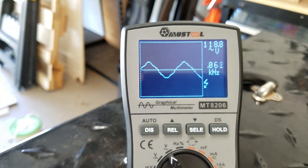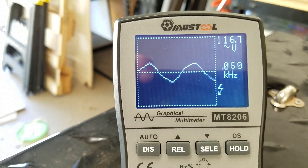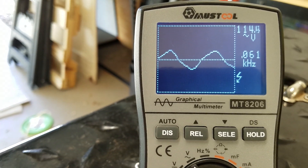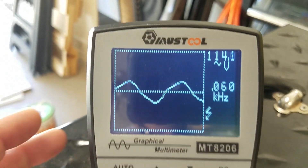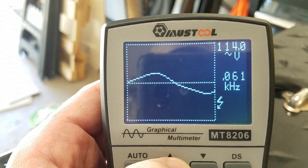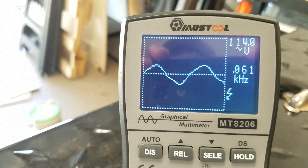Let's go to the air conditioner and see what it does. Let's turn on the old air conditioner. The generator just snorted — it's assuming a little bit of load. We can see where the voltage is. The waveform — yeah, it's definitely showing that it's under load. It's not a perfect sine wave anymore. Let's throw the jigsaw on top of it and see what happens. The jigsaw really doesn't make much of a difference.